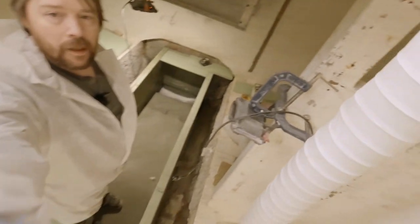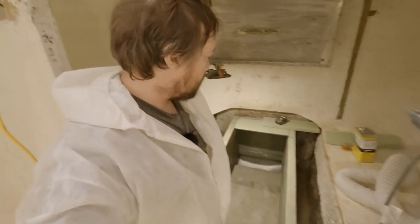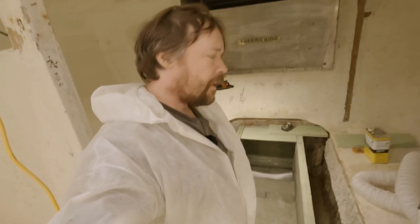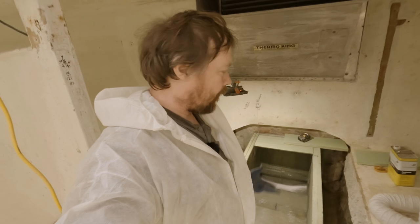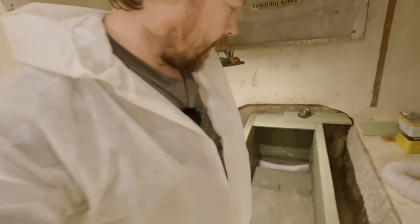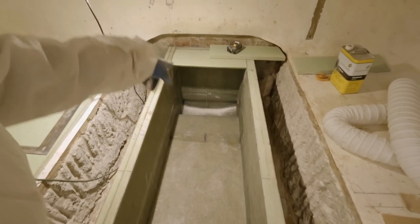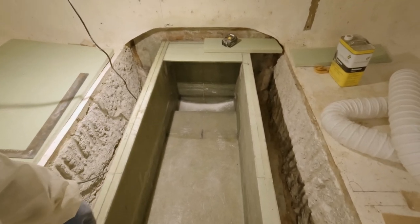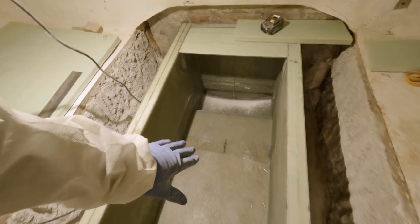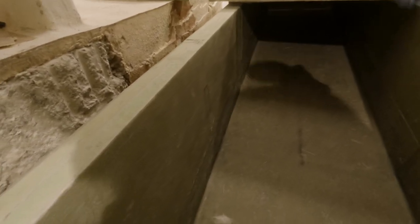People also asked how we intend to keep the shaft alley dry and how we'll set up our pumps. The answer is: the shaft alley before was just flat and had a tiny little sump. When we poured the concrete here we stopped it short to create this nice deep sump right here. This does get water in it from the shaft packing - it needs to leak because that lubricates the shaft and also helps keep it cool.